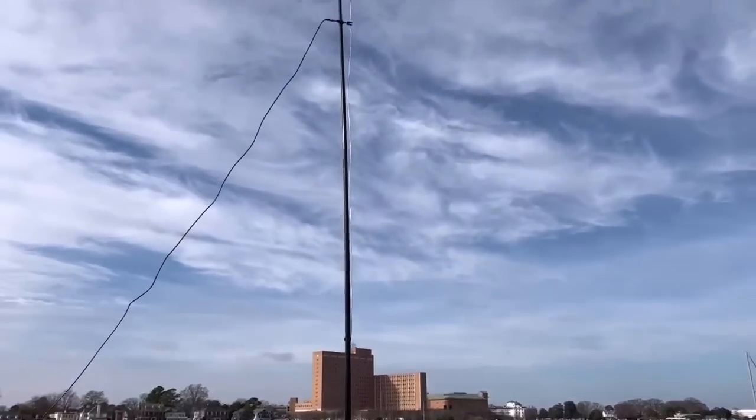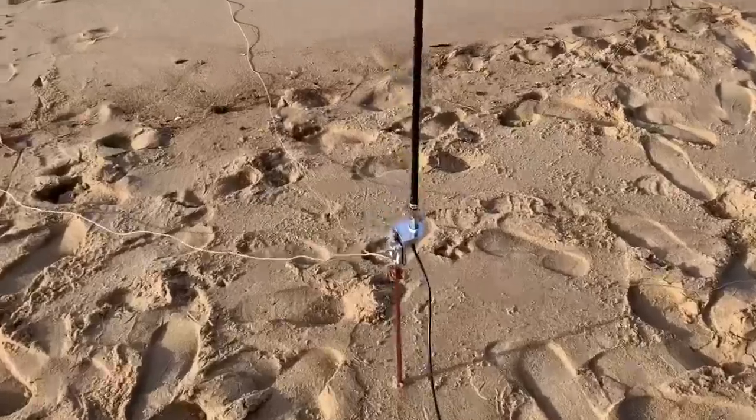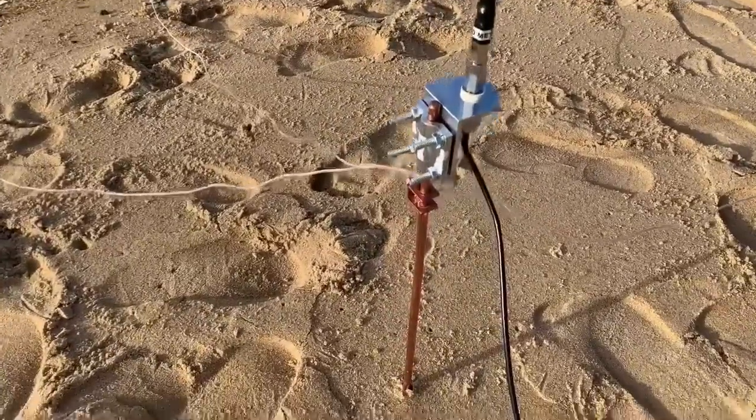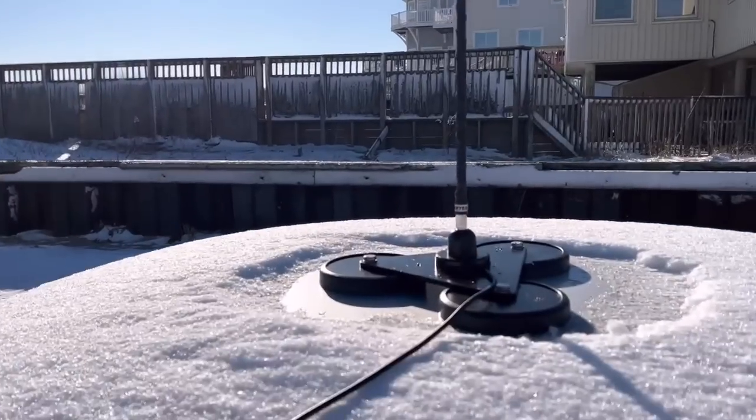A vertical dipole is a truly resonant antenna for wherever you built it. I've built one for 10 meters — all you need is the dipole and a radio. It's a resonant antenna for that band. Along with that, there's hamstick verticals. You can purchase hamsticks for whatever band you're operating on, put them on a stick or a mount on the ground, and put some radials underneath it. Hamstick verticals are great. You can also put a mag mount on top of your car with a hamstick vertical and operate mobile with those as well.